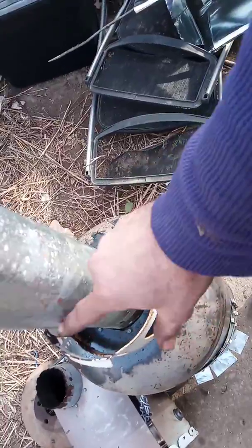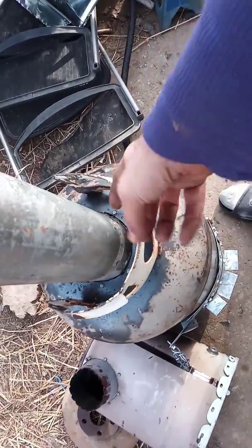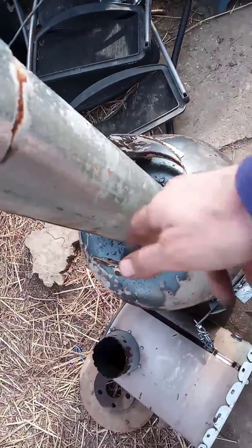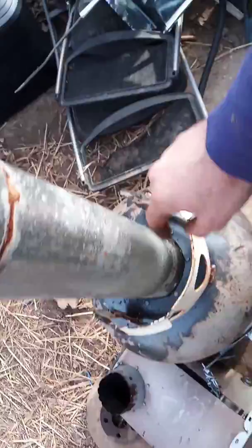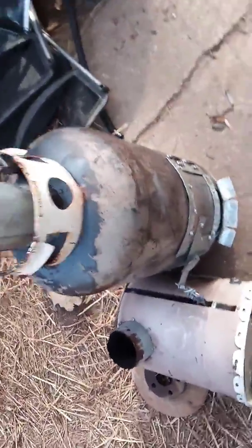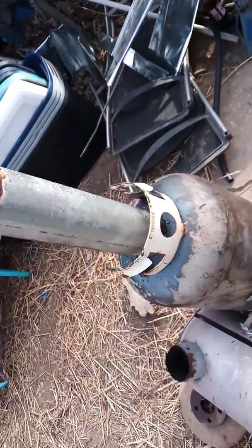And I pulled it tight, and I felt where the little flaps were, the little tabs that bend over. And I marked out 8 screw holes and drilled them out. And those are sheet metal screws. Screwed it in, it was good to go. And I'm going to get some of that vent taping. And they've got a vent silicone and whatnot. But you can see it over here. Okay. So, yeah. The rest of these, I drilled them out, self-tapped.